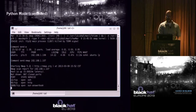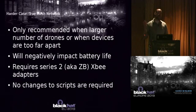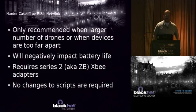Right. Now, one thing that you might run into is buffering. Sometimes it'll save up those commands. You have to make a choice. Do you want to just keep flushing those buffers and sending every single line as it comes? Well, that's kind of a performance bottleneck. Or, you're like, hey, I only got half my results. Well, just send in another command. Just give it an ls or something. And okay, now it bumped the rest of it out of the buffer and off you go.